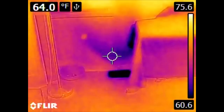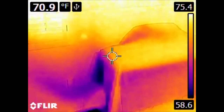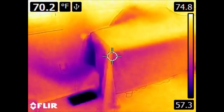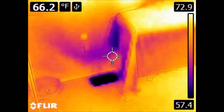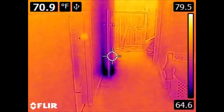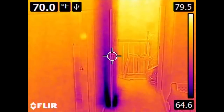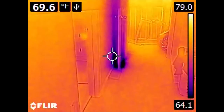Here on this wall we also have another air conditioning output. We can see the influence of objects around our vents — the air is cooling this wall and also cooling the side of this cover. If this cover were any further over, it would obviously interfere with the airflow and prevent the cooling. However, a better example of that occurs over here. We can see that the door stop for this door stops the door immediately over a vent. So the door is quite cool, and the airflow constrained behind the door makes the wall quite cool, but it's not really helping the rest of the room.